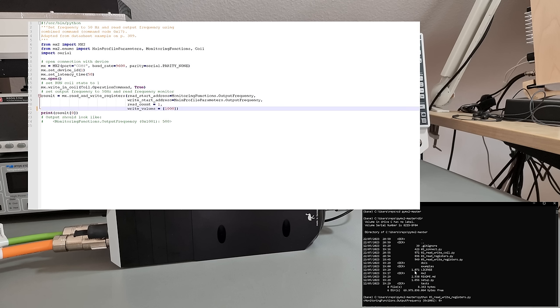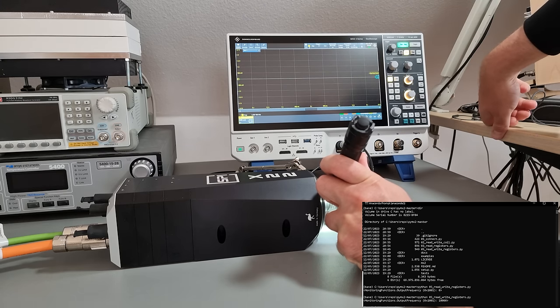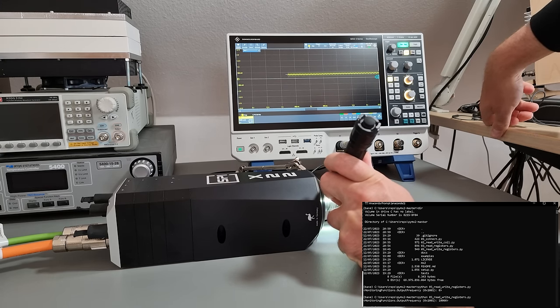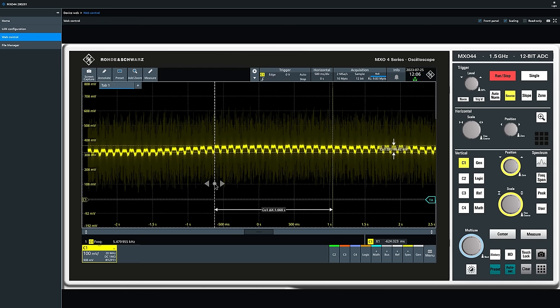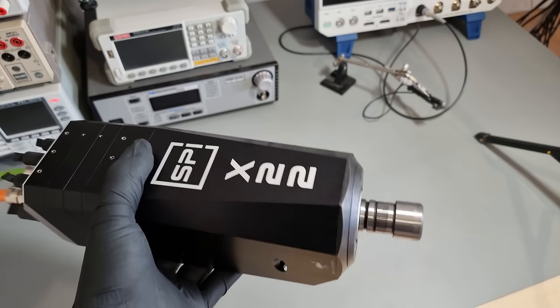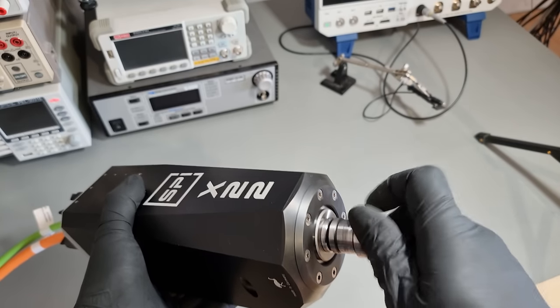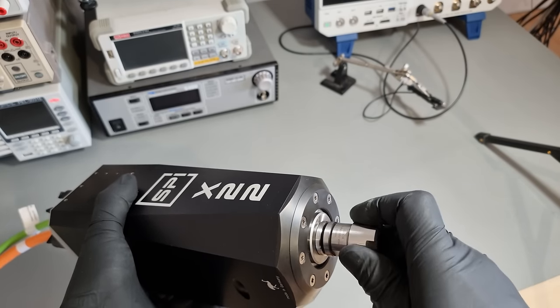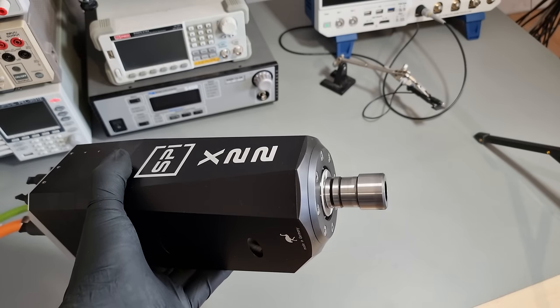If we ask for a 10 Hz VFD output frequency, with the oscilloscope looking at a flattened part of a tool holder using a light sensor, we can see a nice round 200-millisecond period for a spindle shaft revolution — five revolutions per second or 300 RPM. Exactly as the usual RPM formula for four-pole motors predicted. According to the X22 datasheet, without closed-loop encoder control we can reach peak torque somewhere around 5000 RPM. As soon as we do get closed-loop control, I expect this will behave like an unstoppable kilowatt servo.